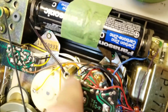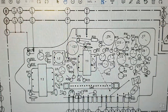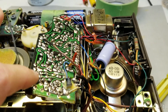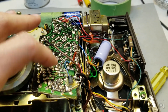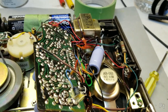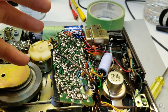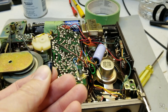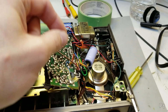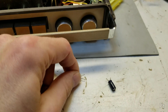I'm going to try and find where the wire to the head goes and see if I can just get some audio going to that. Something as silly as this little cassette deck - I was able to find a service manual on it. Never the complicated stuff, always something like this. So there are three 10uF capacitors between each amplification stage. I'm hoping it's not a transistor - these caps are probably not great. So far every cap that I've bypassed from the back has improved something. C14 completely got rid of the motor noise. I'm going to tack on some 10uF caps over the coupling caps that go between the audio stages to see if I get anything. I just pulled these off an old sacrificial board so I'll test them, make sure they're good.